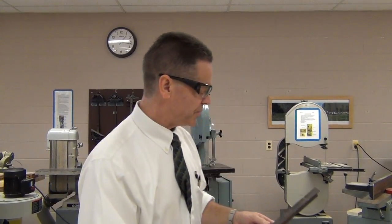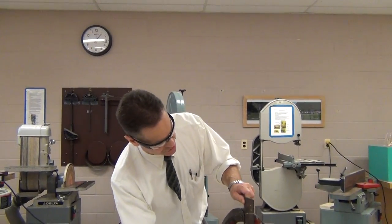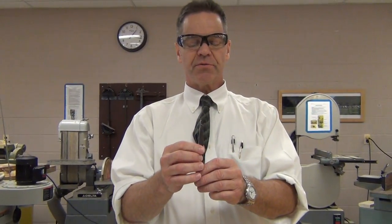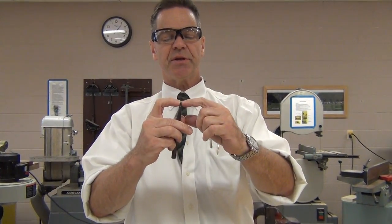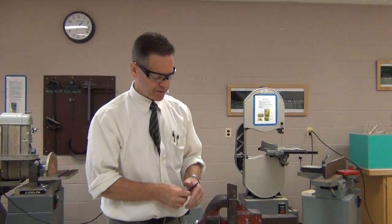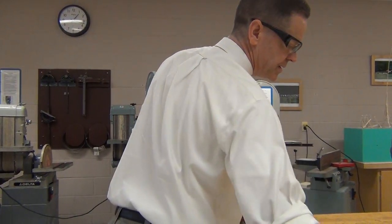Let's see a couple more things here. I'm going to go on this side of the steel and make a little cut with the cold chisel. As you may have seen in another video, the cold chisel has a very blunt edge — it is generally sharpened to a reasonably sharp edge, but in comparison to the wood chisel, the angle here is very big and thus this thing is very tough. This edge is not going to get dulled that easily, even though we're going to use it to beat on a piece of steel. So I've got this piece of steel here in the vise nice and tight.